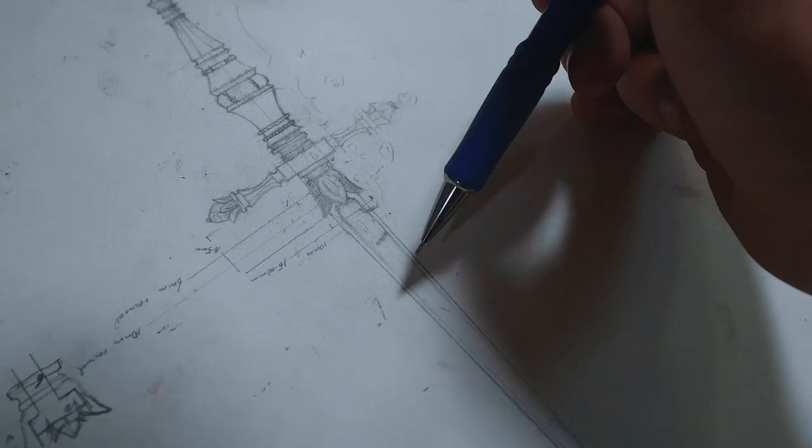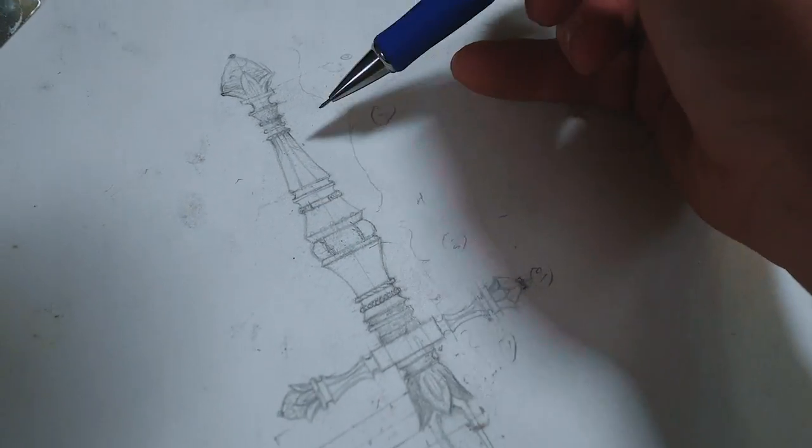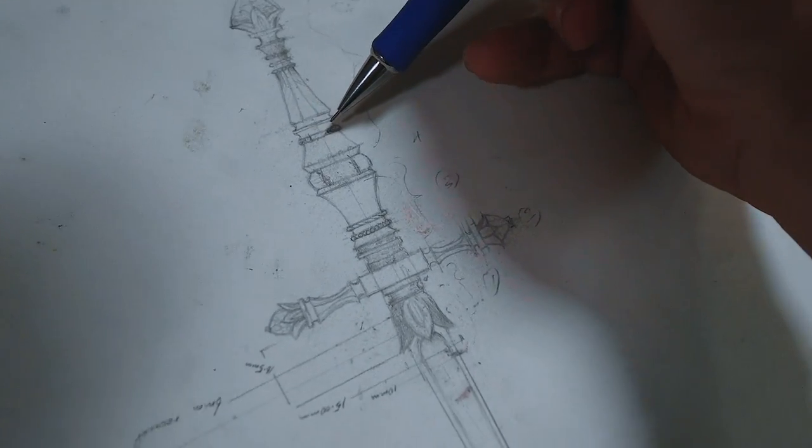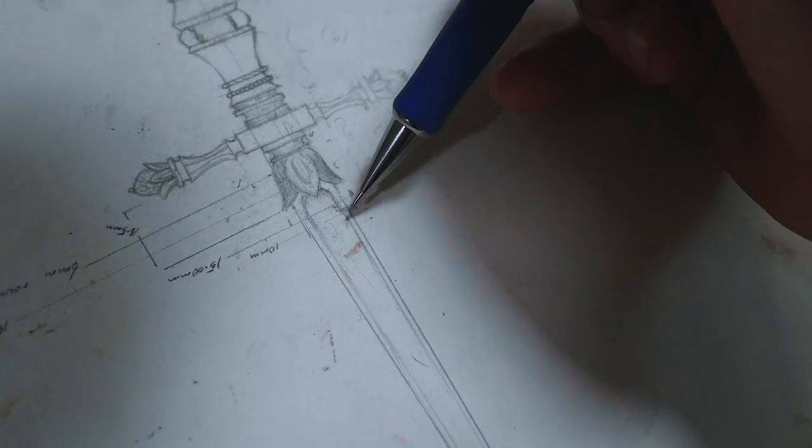We spent some time thinking about how we could adorn this. We wanted to put some gemstones in that particular bronze piece, and we were thinking about how we were gonna lay it out. Now we have a tri-edged dagger. What we're gonna do is put 6 lines of diamonds in the piece, a little pave setting, so that we can reflect some of the shapes and geometries in the rest of the piece, and follow along from the lines up here and have your eye go on this beautiful journey from leaf to facet, to diamonds, to leaf, to knife blade. I think it's going to turn this into a spectacular piece of art if I don't mess up.